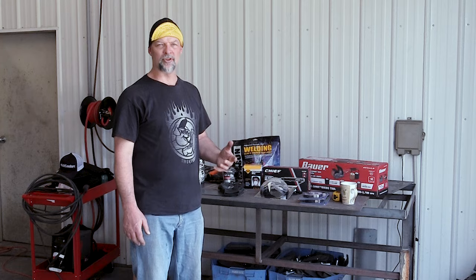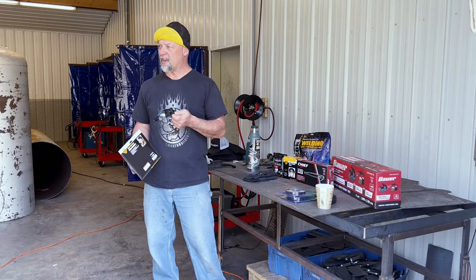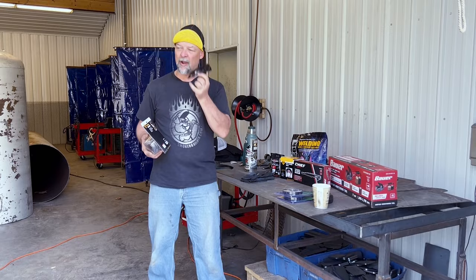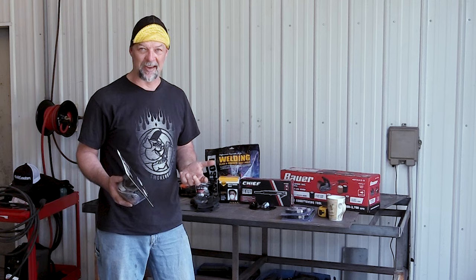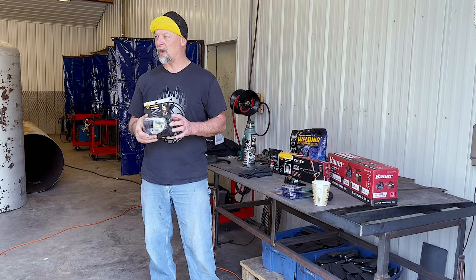You could just wear a pair of safety glasses — these happen to be tinted like number threes or something. But I've actually worn these before and had a chip of paint go behind my eye and got something called chemical conjunctivitis from it. That's basically pink eye induced by dust and other kinds of stuff that gets in your eyes. Ever since then I've worn some kind of splash-proof goggles.